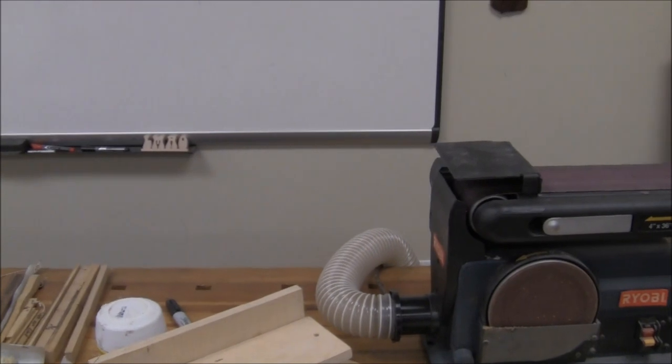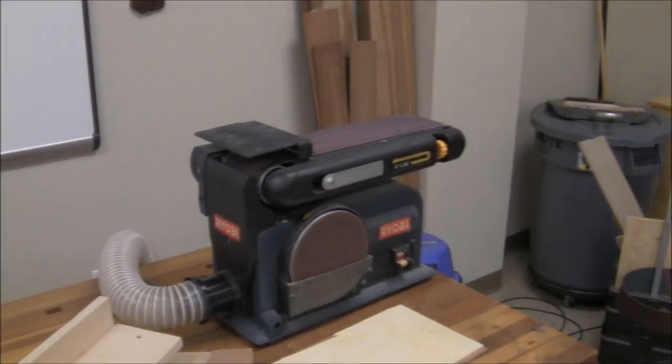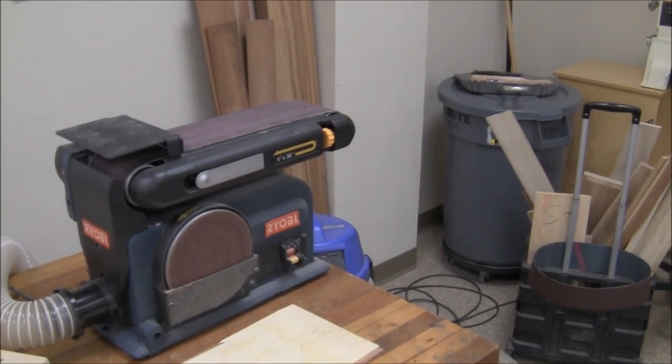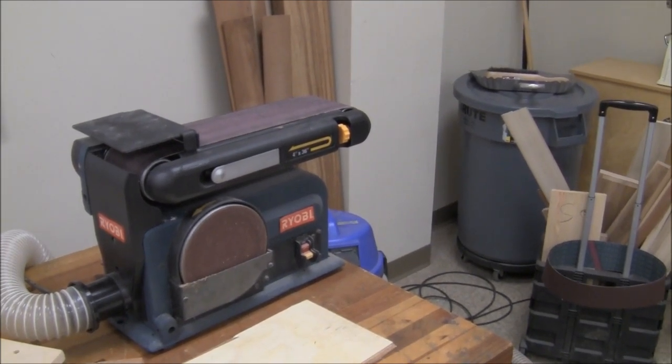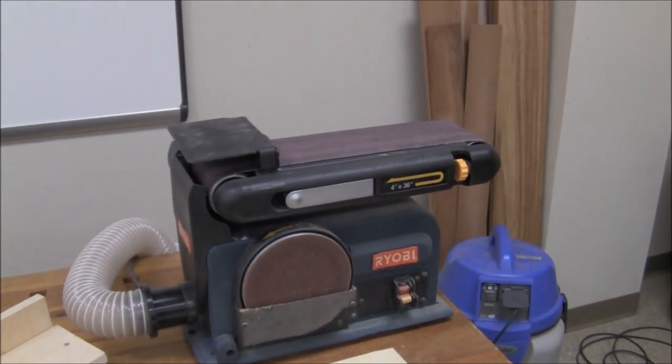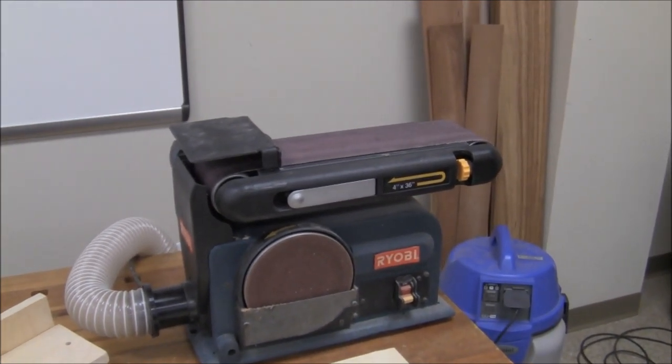What I want to do is, as I'm shaping this blade on the sander, sometimes I'm trying to get it to a point coming out, and I'm shaping the shoulders. But I have to constantly look at it to see whether or not the blade is straight. Sometimes the blade will be straight, but it'll be twisted on the bottom. So that part on the bottom, when I sand it, I need to sand it so I can straighten the bottom up. Now in doing that, the blade might want to be that much shorter.